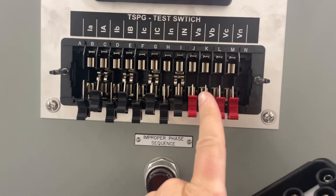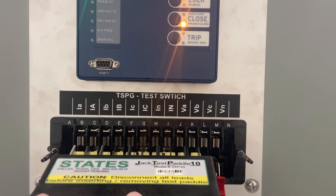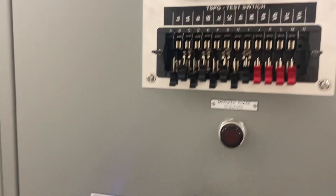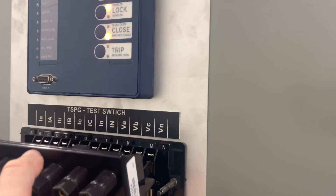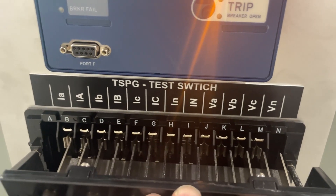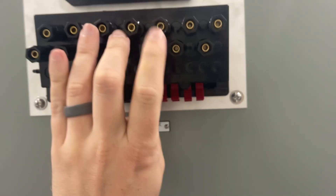But on the 14-pole, States makes their test switches to the same pitch as the 10-pole. I've got my 14-pole States test switch paddle here, which is the same pitch — everything is going to fit. But the ABB 14-pole test switch, and of course the matching ABB 14-pole test switch paddle, are slightly different sizes, so the poles don't match up all the way. There's a misalignment because ABB thought they should save space on the 14-pole ones and cram them together.